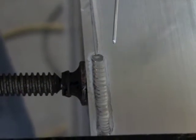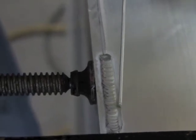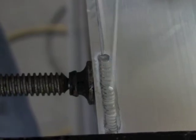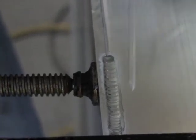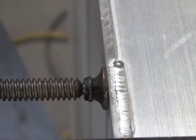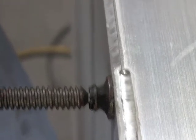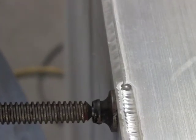You can see here, because we've got really thick material, my bead's a little bit wider here, and you can see every dip that I'm putting in right there. But you can see, as the material heated up a little bit, it started to flow a little bit better and got a little bit wider than it was right here in the beginning. As this whole sheet heats up, it'll become a little bit easier for me to weld.